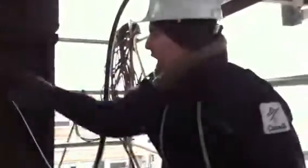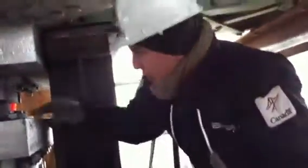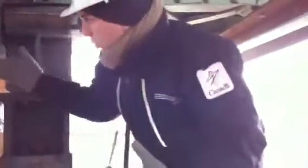We will not need these temporary columns anymore. Because right now, all of this is necessary because we don't have the space to lift the bridge right here. We have to put that kind of column. But this piece of steel right now is brand new. When we come back in 25 years, the jacks we will use to lift the bridge — we will put them just right here. So we will not need this kind of column. We are also working for the future to make sure that when we come back, it's going to be easier to just lift the bridge with powerful jacks here and here and change the bearing device.